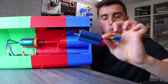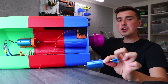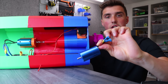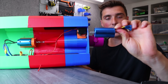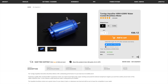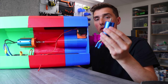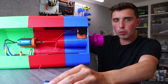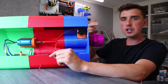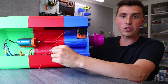The old motor was 1700 kV, which means it likes to spin really quickly — but it just couldn't, because the propeller was so big and moving all that water introduced a lot of friction, and that friction turned into heat. That's why we saw this motor overheat all the time. The new motor is only 620 kV, which means it likes to spin a lot slower. That may not sound good, but an electric motor is only good when it's actually capable of moving the propeller. A bigger, lower-kV motor will have a much greater chance of rotating the propeller, so it ends up more powerful and without the overheating.